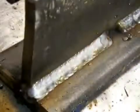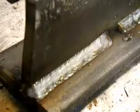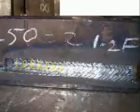There's a T-joint. I'm going to do the same thing here. You'll notice the stick-out's a little long — that's because I was trying to weld around the camera and couldn't really see it that well. But you'll see when the lens is lifted, it's a pretty good result anyway. It's pretty forgiving if you have everything else set up right. See, that looks familiar? Same technique — just barely looped back into the puddle.